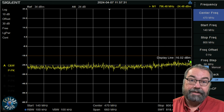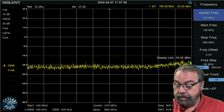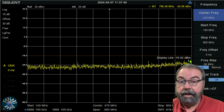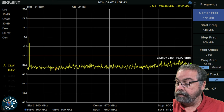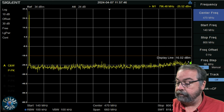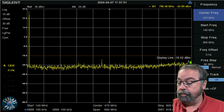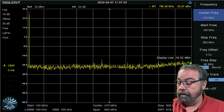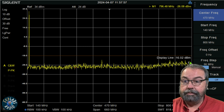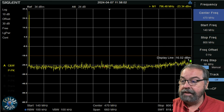This radio has two power levels: low power and high power — Yaesu rates them at half watt and one watt. The first thing we're going to do is test on high power. Let's key up. That's high power. It looks like we're about 30 to 31 dBm of output power. And you can see nothing is above the minus 16.02 dBm line. So this guy is just aces.